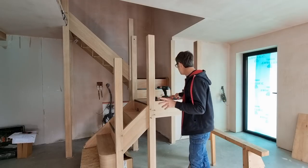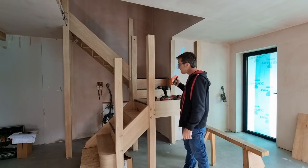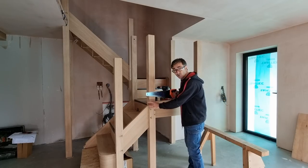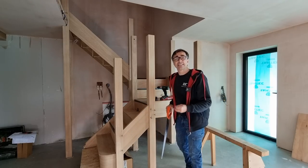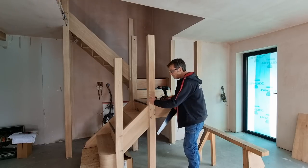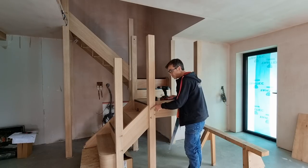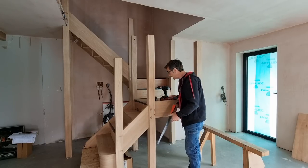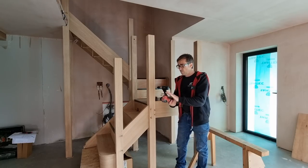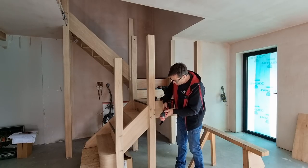The first job I'm going to show you is how we clean these dowels off. You can use a handsaw - put something between, even a piece of card. But the more they're sticking out, the more you've got to clean off. Or you can use a multi-tool, because the blade is dead flat and you can literally start it off here. If it's softwood and it's going to be painted, it's a little more forgiving, but this is oak.